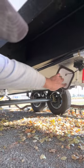The first thing you need to do is drain all your tanks — your gray water, your black water, and preferably all your fresh water. I'm going to show you how to do that first. On my trailer, just like many others, we have what's called low point drains and main tank drains. The first thing I'm going to do is come under my trailer here and point out a few things. I've got this cover on here.